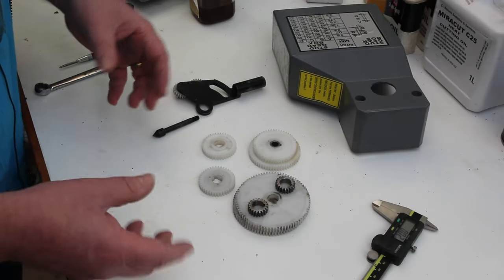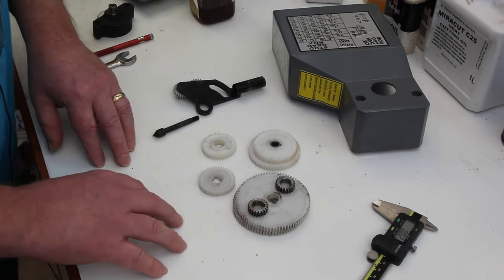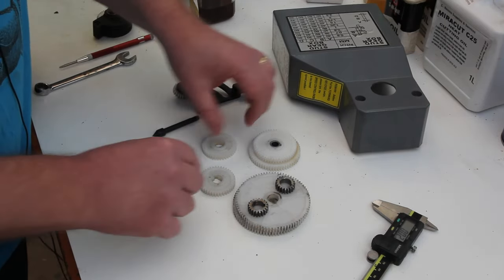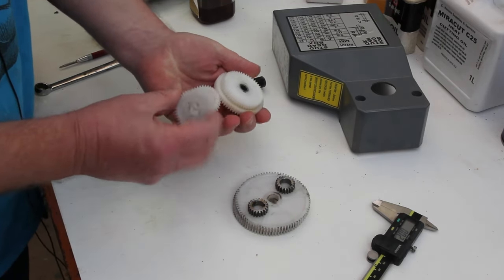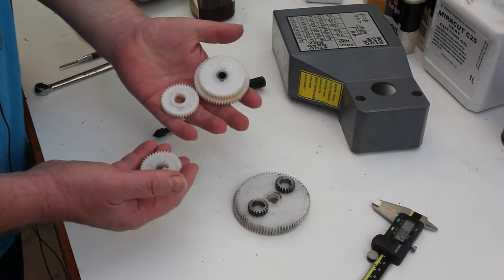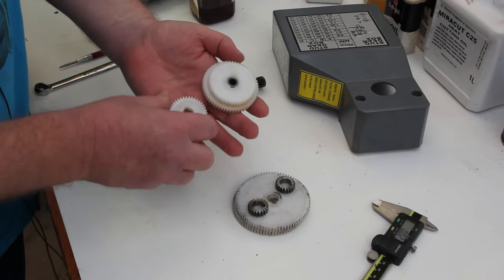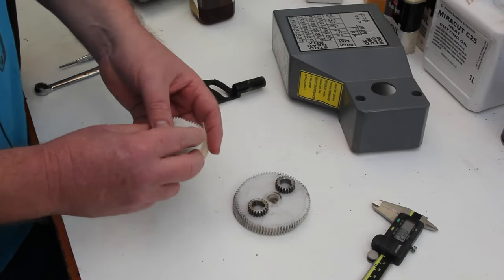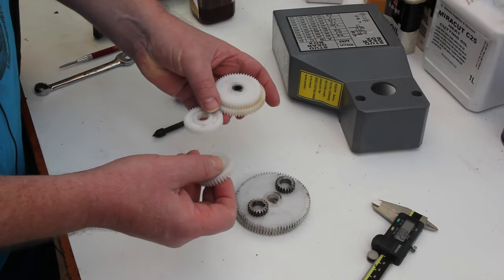Okay, so before we can start making the new parts of the lathe, I'm going to have to actually put the lathe back together and get it working again. So I'm going to need to rebuild the gearbox. Originally, I had these gears in the gearbox, set up to give a reduction down to a 1.25 millimeter screw pitch on the lead screw. That was for a screw thread I was going to cut, but obviously I can't cut the screw thread because of the aforementioned problems.